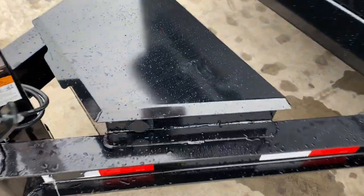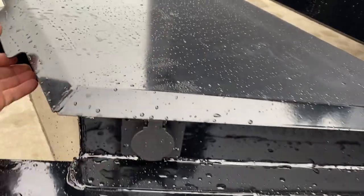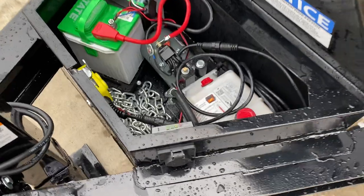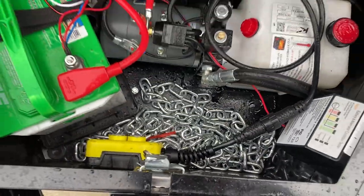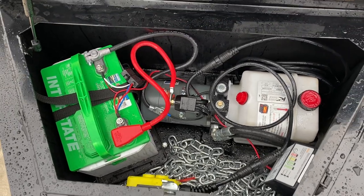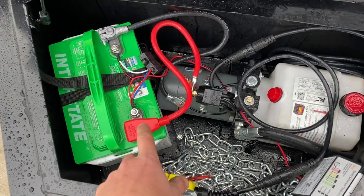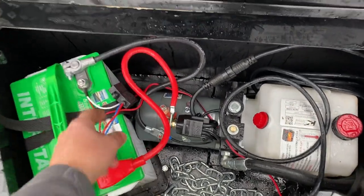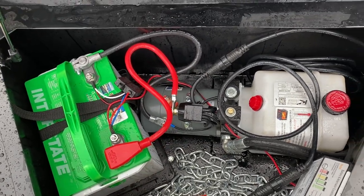A 12K jack is now standard equipment. It's also got an integrated 110-volt charger — simply plug in an extension cord to house current to help keep your battery maintained. This is going to be a 5-amp charger with a 140-amp-hour battery, so keep in mind that's about 30 hours of charging to fully charge a discharged battery. It does have protection on the positive terminal and an inline circuit breaker. It is currently an Interstate deep-cycle marine battery.